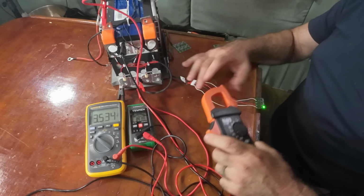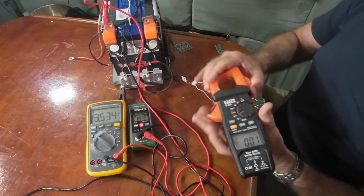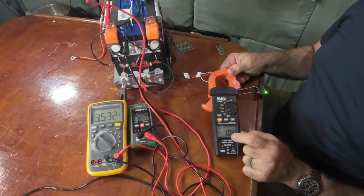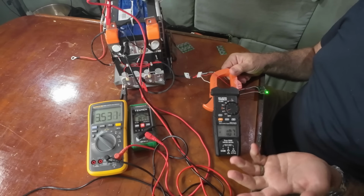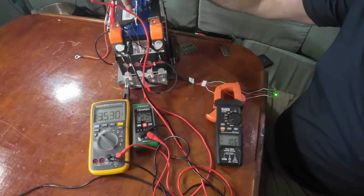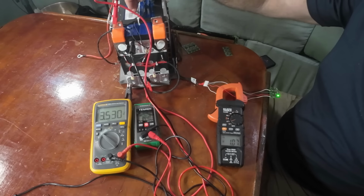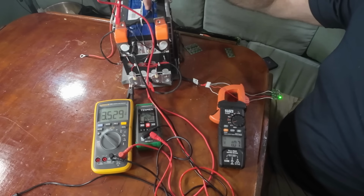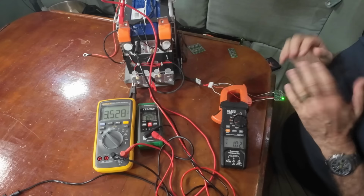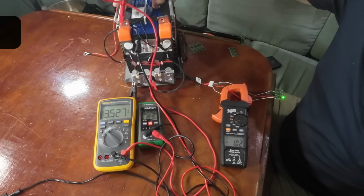And we'll take a reading. Currently calibrated to zero. Okay, we're passing over one amp, mostly between these two cells, I believe. Yeah, it would be between these two cells. Probably a little bit between these two, but we don't know this voltage. Anyway, we are charging this cell off its neighboring cells.